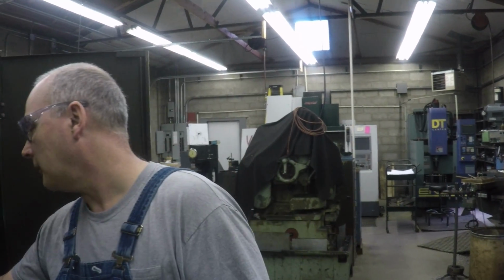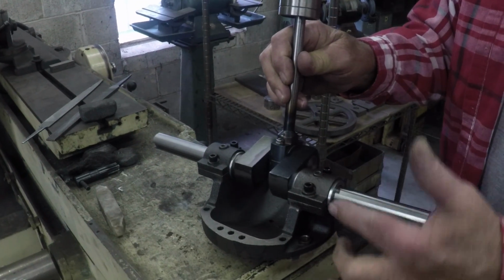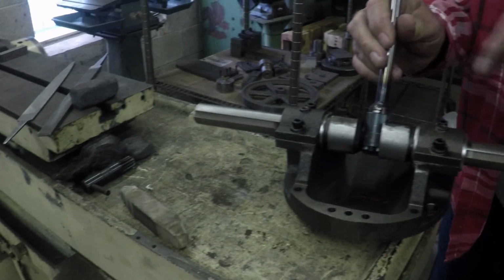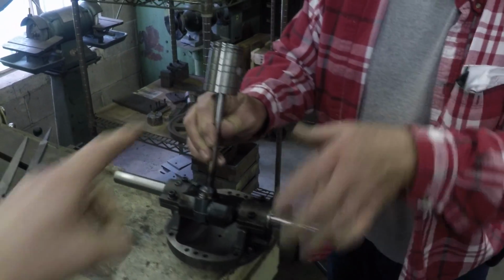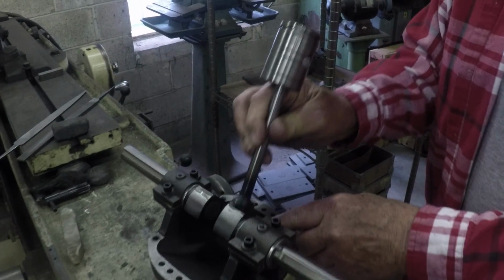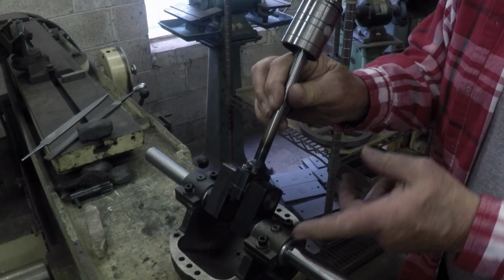We paint everything here. So we were just talking about grinding, and you made everything here. We pour the Babbitt bearings. We have a Babbitt bearing in the rod, and the other Babbitt bearing. Our oil cups go here. You make the piston and the rod. We take one ring on the piston, we make all that. This is ground in the grinder. So Babbitt is inside of here, right here.